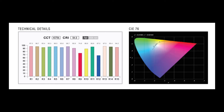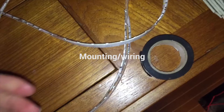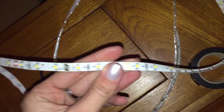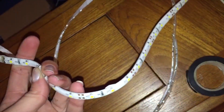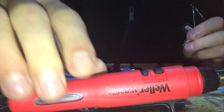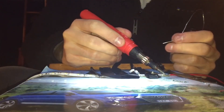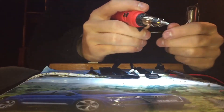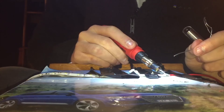When it comes to running cables and soldering, I don't have many good tips. I know there are special fittings for LED strips to connect them to cables, but I didn't find any close by, so I ended up soldering the cables directly to the LED strips. I would strongly not recommend doing this — it's a real pain in the neck to get solder to stick to the soldering points, and you have lots of insulation to scrape or burn through.